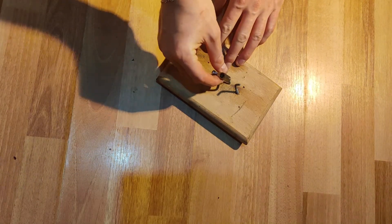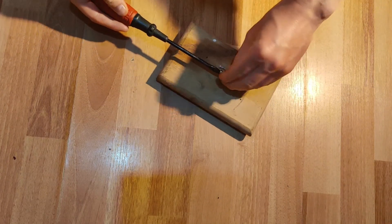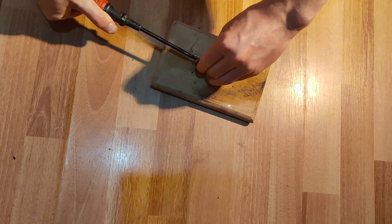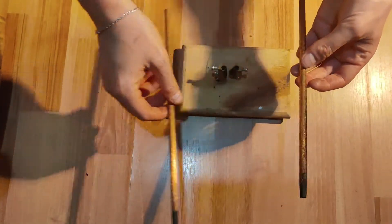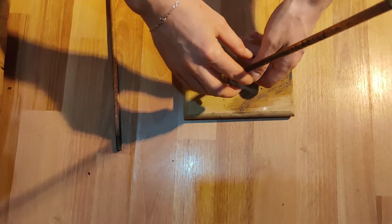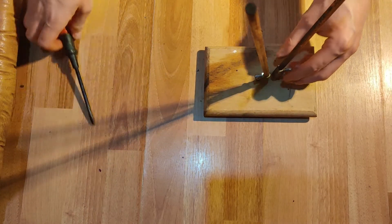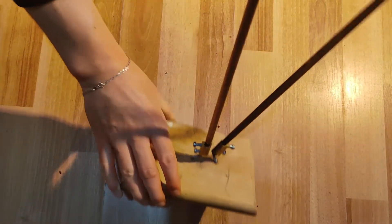For building the ladder, I used a piece of wood in which I have bent two screws at an angle of roughly 30 degrees. Then I used a pair of wire couplers which I have tightened in place using a screwdriver. For the last part, I used a pair of graphite rods. Graphite distinguishes itself from other conductors by withstanding the high temperatures of plasma. On the outside, it is covered in a thin layer of copper which will evaporate from the extreme heat of over 3000K. This is the finished product — I made it so the angle between the rods can be adjusted.